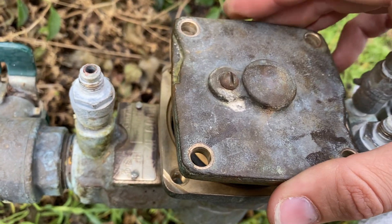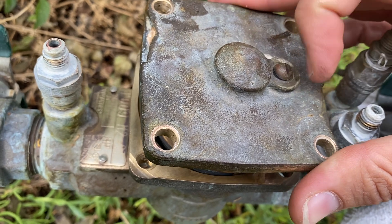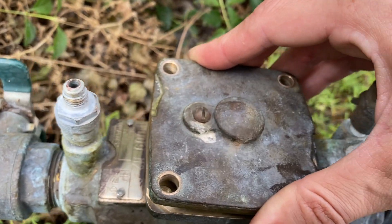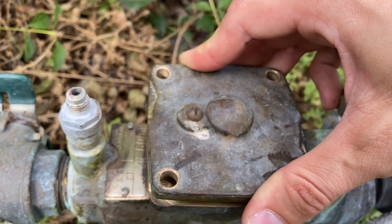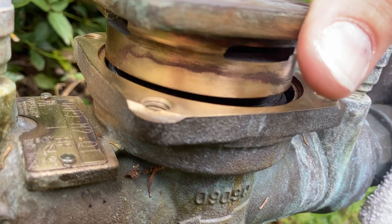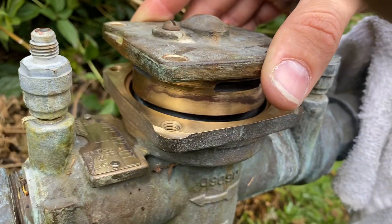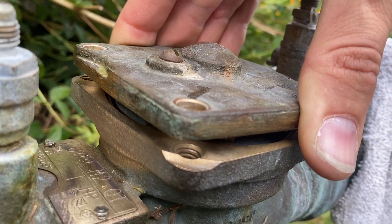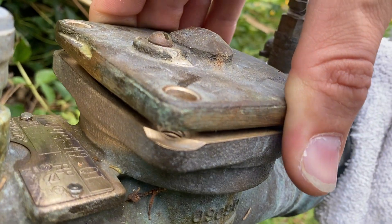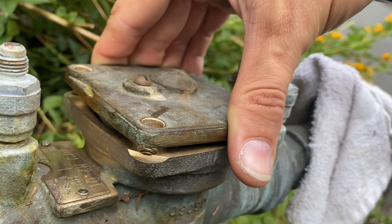It's not really directional, so you could have it towards the number one ball valve so it bleeds air out that way, or you can have it towards the number four TC, towards the number two ball valve. From there, just put in your bolts and zip it tight. You want to do an equal compression on that spring when you're zipping it tight — if you're getting all cockeyed, it's going to snap the RV fin guide coming through here. You want to do it by hand first and feel the RV guide go through the seat, and then tighten it all with the same pressure on each side, otherwise you'll end up tipping it back and forth.